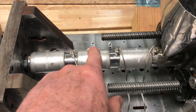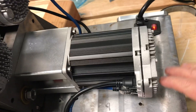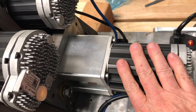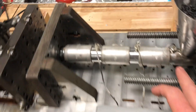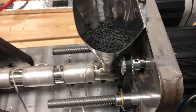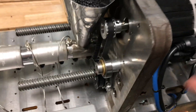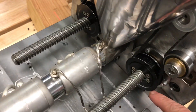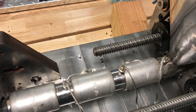There's a barrel, and inside this barrel is a screw. There's a pellet that melts down. This back motor drives the screw, which pushes the pellets into the barrel as it heats them. These two motors right here control the forward motion of the screw — two rotary ball screws that drive the screw backwards and forwards. And that's how it works.